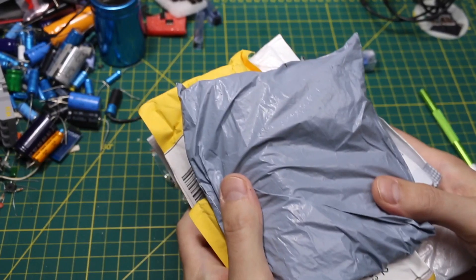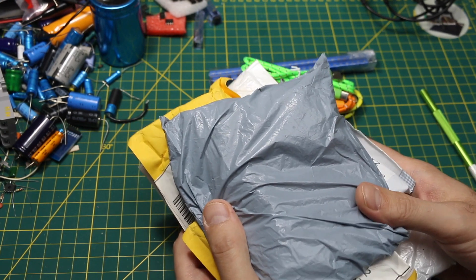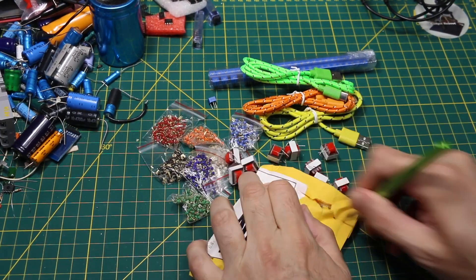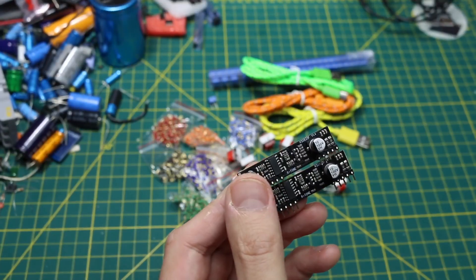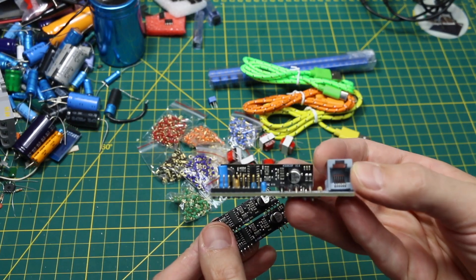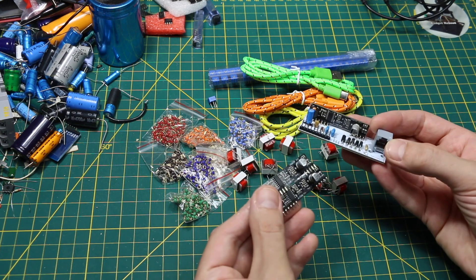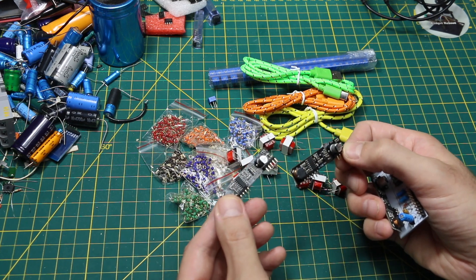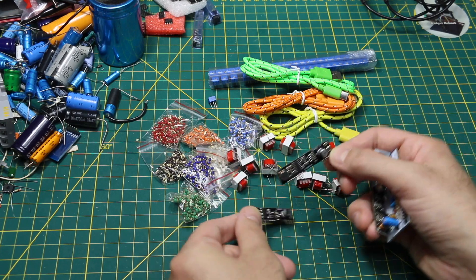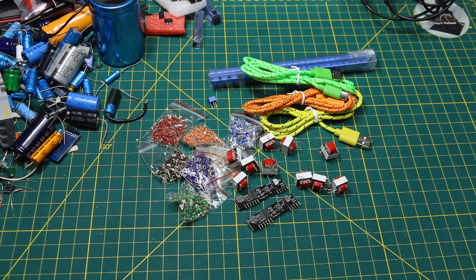There are seven items here, all from the same category. I ordered them recently and they all came relatively quickly, so I'm just going to open all these at once. We have 600 ohm to 600 ohm transformers, and a couple of SLIC modules — subscriber line interface circuits, the KS0835F — which I've used before on a breakout module and on an ESP8266 prototype for phone line experimenting. Now I'm doing the ESP32 version where I need two identical boards, each needing a phone line controller.